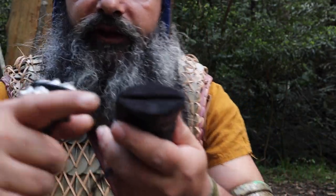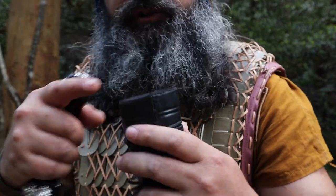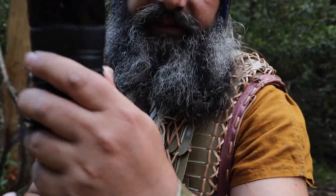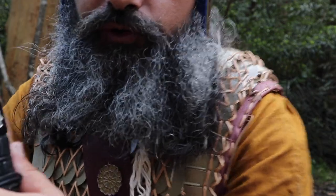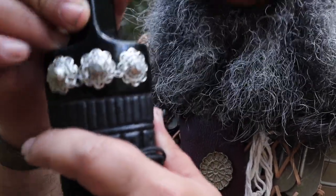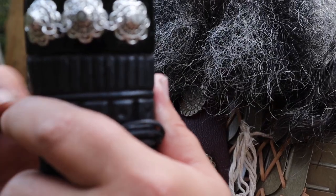So here you've got some velvet lining the scabbard. I figured out why sometimes you see velvet on the top of the scabbard. When you're stitching the leather at the back, because you need to fold the leather over under itself, it's causing two layers on one side, two layers on the other, right up at the top. So what happens is when you marry, because I made this scabbard here so that it sits flush with the handle, but after you're putting on the leather, you've got those two bumps at the back where the stitching has happened. And sometimes what happens is if you don't put the felt, you'll see the blade shine through, which means it hasn't been fully closed. But that felt allows for that extra leeway to be able to compensate for that 1 or 2 mil, so that when you put it down, it sits and you can't see the blade.